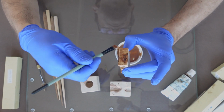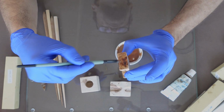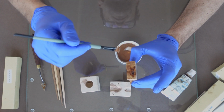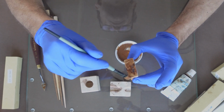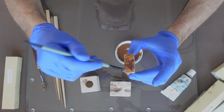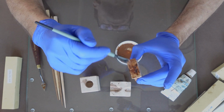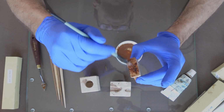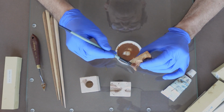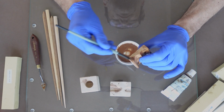And now you can see here that the marks from sandpaper came out instantly. So this shows how important the preparation of the surface is. I'm going to resand it because this first layer is just for strengthening the surface of this wood, because it's very soft and light and it sucks like a sponge. But if you are not going to resand the object you're lacquering, make sure it's really well prepared. And here the same story. The brush marks and the sandpaper marks are more visible.